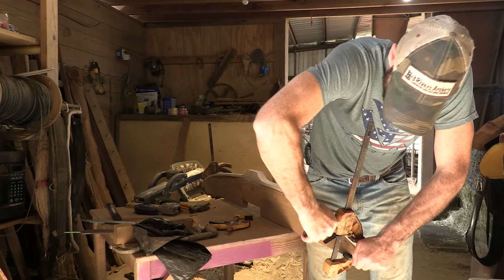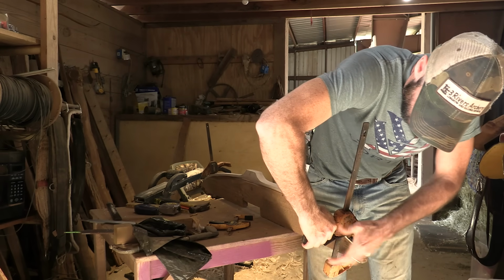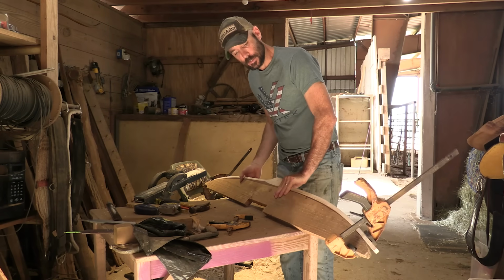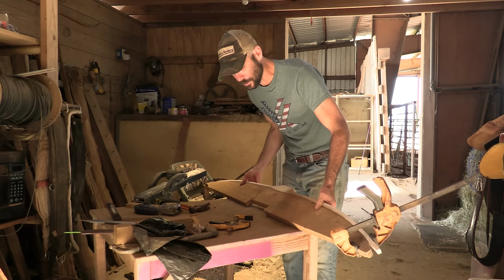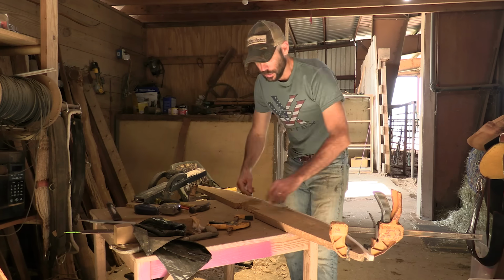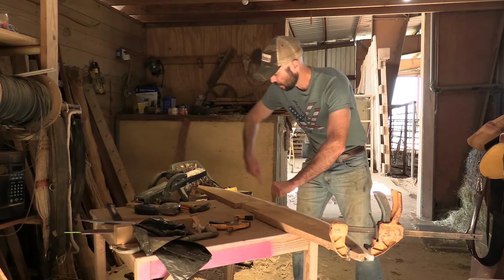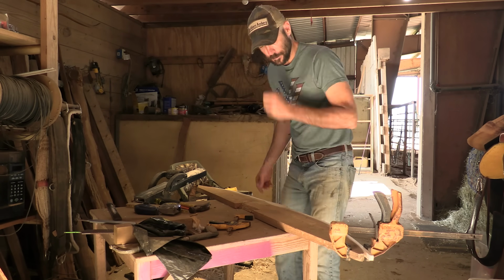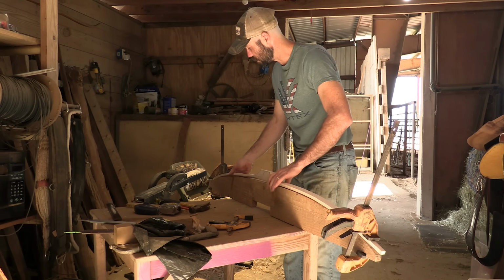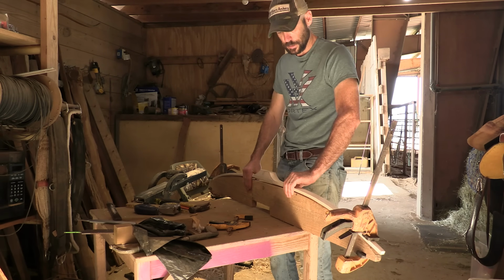These forms are easy to make. I get questions all the time about how to make them. There's nothing to it. Take a 2x6, take a piece of PVC pipe or something else that's flexible, that's got a nice bend to it. Secure the ends, pull it this way, trace the bends out, cut it out, and rasp it off to smooth, and you're good to go.